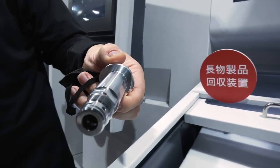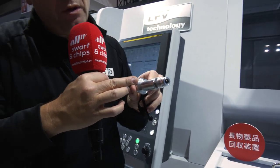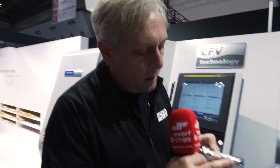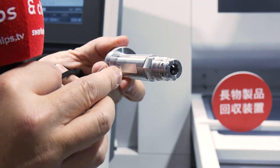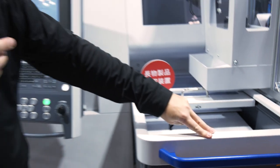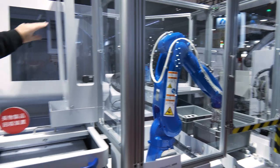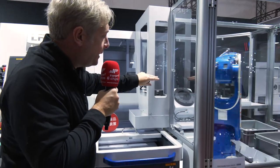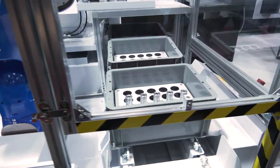A fairly long part — more than 3 times D. They've got cross-drilling and a chamfering tool interpolating in there. Nice little tricky bit of work there. Then automation: taking it from the machine, blowing it, measuring it, packing it. So from bar to finished component, ready to be shipped.